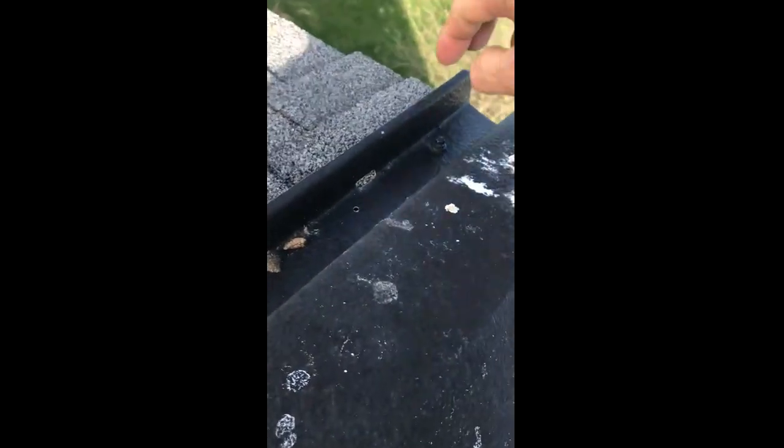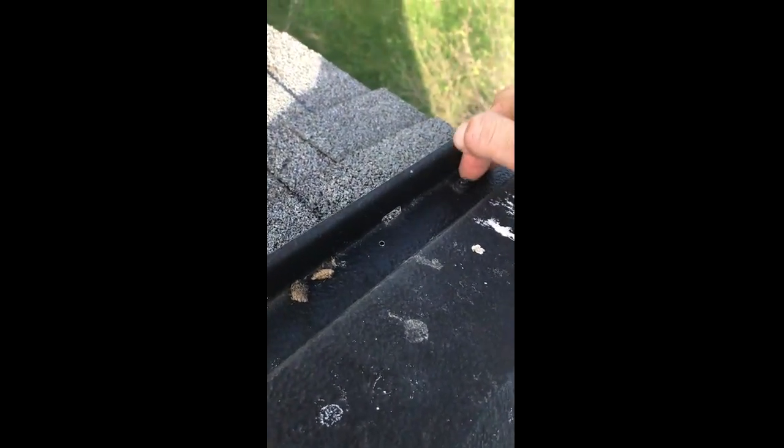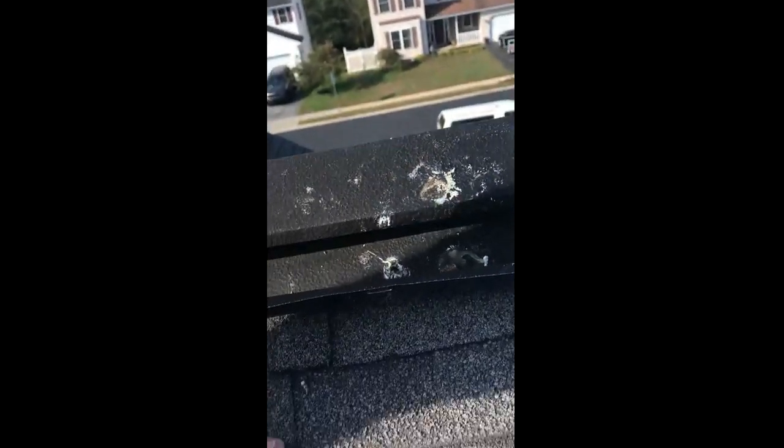Also, the end of the ridge vent on this side is just moving — the screw has lost its hold and it moves up and down. There are some gaps on the end where water could blow in, and that's what caused that screw area to get soft and pull up. Somebody actually put some sealant on this side already.